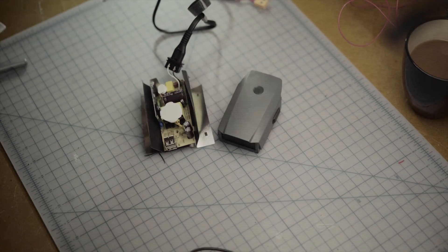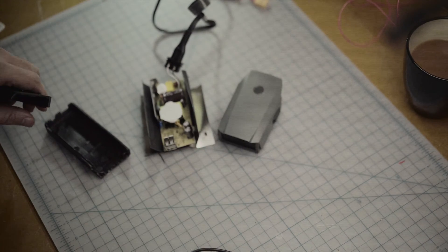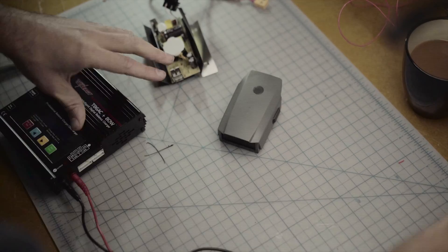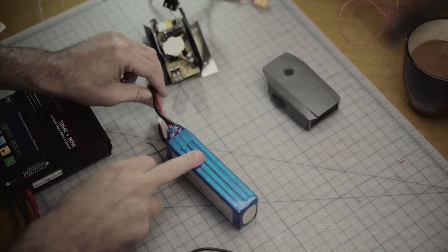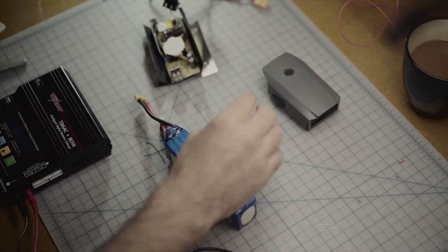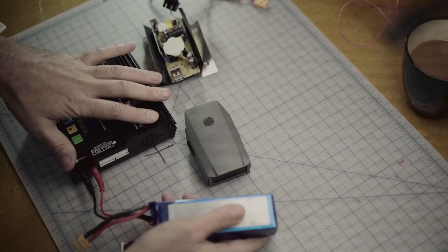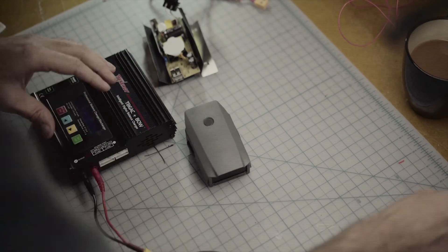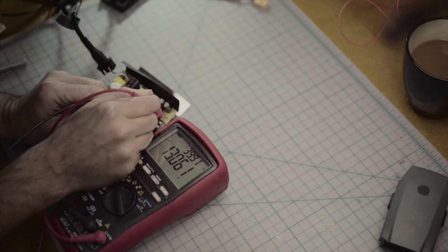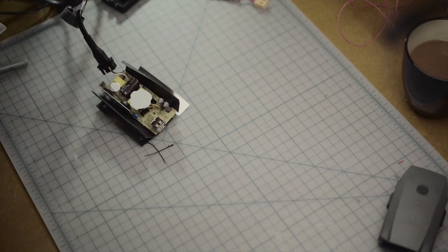This is a 50 watt power supply what they give you — it outputs 13 volts. It's a dumb output because the battery is smart, and so it basically converts to 13 volts, only three and a half amps. Normally with a raw LiPo you need this — you can't just plug into a voltage because it's not managed, it will just overcharge and blow up. This guy has the management built in, it does the balancing and all that with the balance leads. There's electronics in there that manage the battery — it just feeds out 13 volts maximum, three and a half amps.